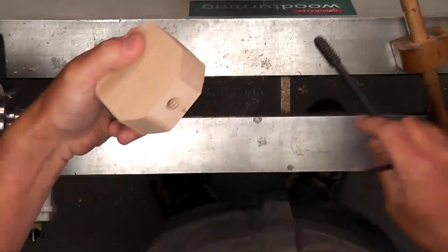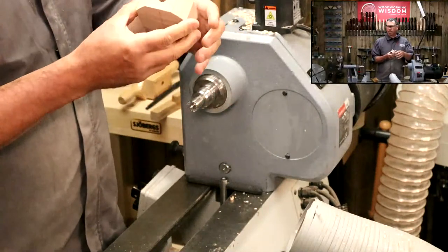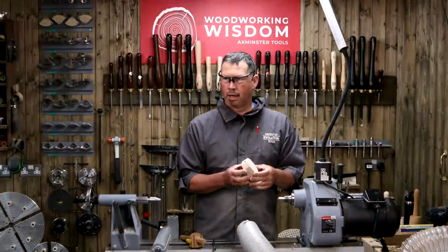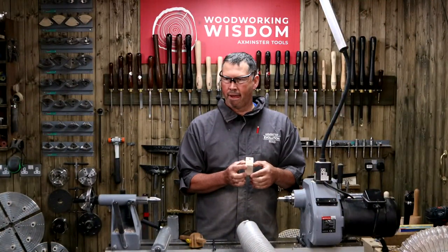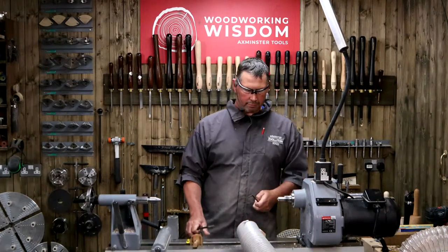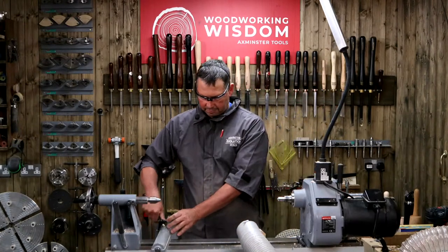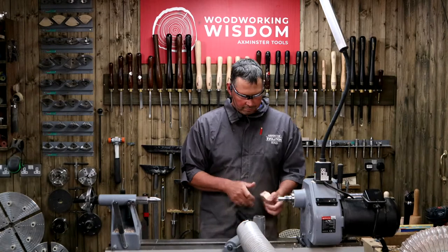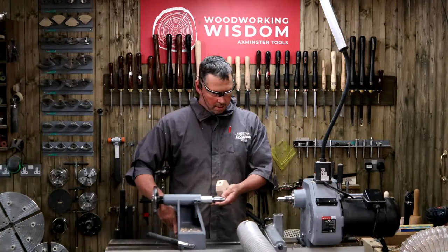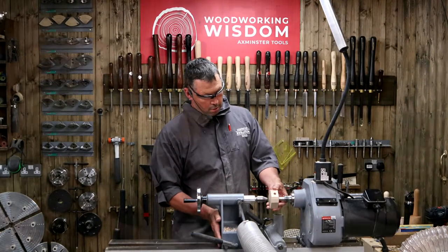A question from Cliff. He's just treated himself to a new cast iron router table, and he's got an oil coating on the top. The answer is yes. When we get any new machine with that kind of oil coating, remove that and put a transit grease to stop it rusting when it's sat in a warehouse or something. So remove that with wax and polish remover, or even a light white spirit. Give it a little clean down, and then yes, apply some sort of machine wax just to stop any rust building up and make sure everything slides beautifully over the new surfaces.